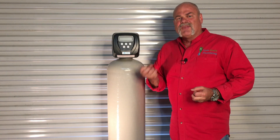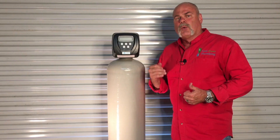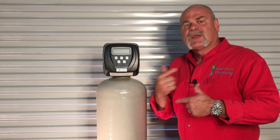The catalytic charcoal in it absorbs everything — all the impurities that come through the water — so they stick to it. This thing regenerates every three weeks for 3,000 gallons. The good thing about this compared to a water softener is that a water softener wastes a lot of water. These filtration systems only use about 32 gallons once every three weeks to clean itself.